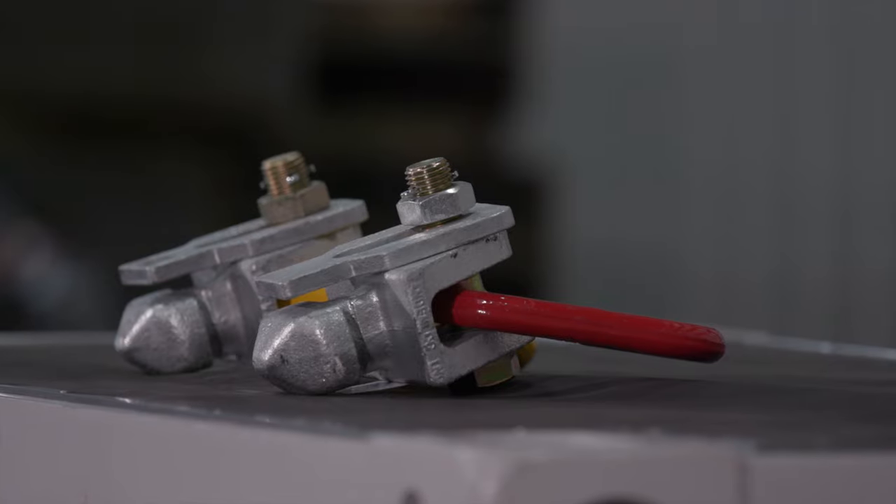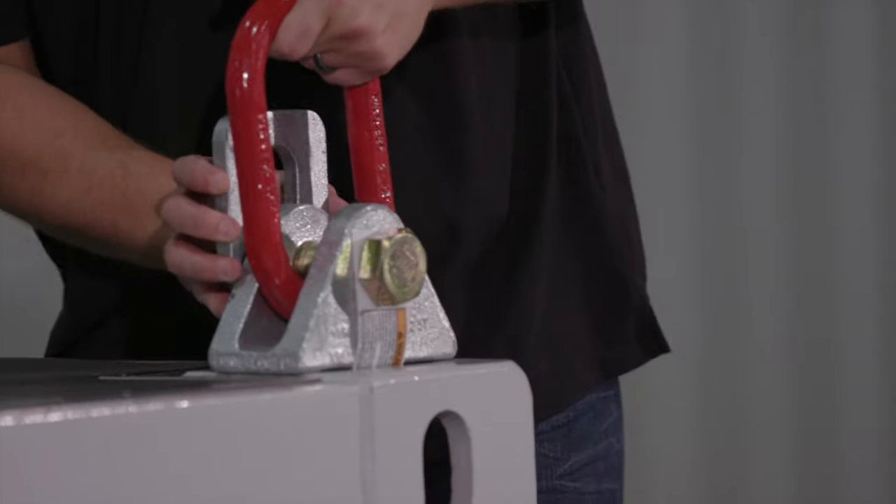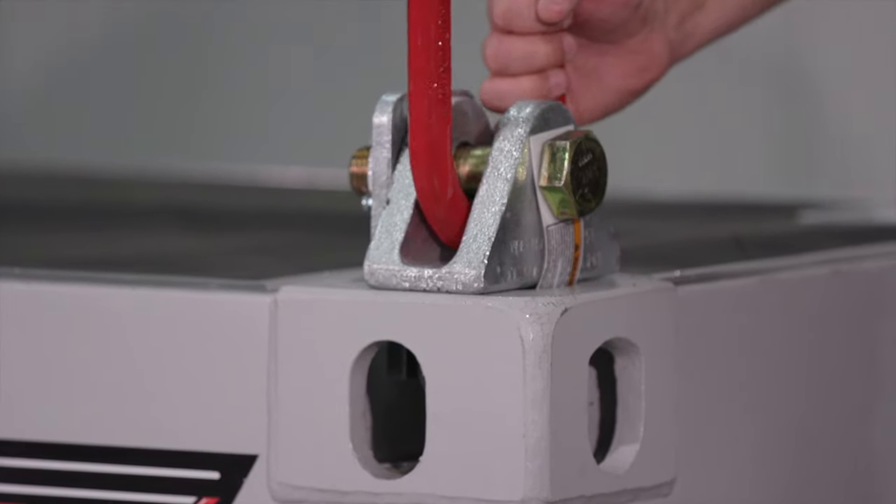With master link, this lift lug is meant to be used when lifting a container without a sling angle. When using the top lift lug, it must be inserted in the top corner fitting and rotated 90 degrees. After the lift lug is rotated, the gravity plate will fall into place, providing an extra measure of security.